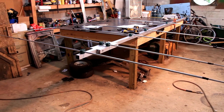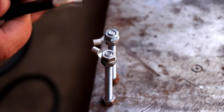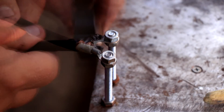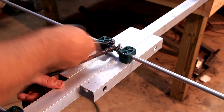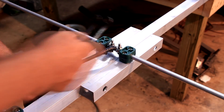Now is a good chance to step back and admire your work. We are almost done. Next we need to get the coax ready to attach to the driven element. I made a fixture to help me in preparing this. It is just two threaded rods long enough to hold the ring terminal spaced the same width apart as the driven element attachment points. This helps in getting the tape wrapped around the bare wire without having to maneuver around elements and booms. Now that the coax is attached, we need to test it and see how we did.